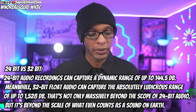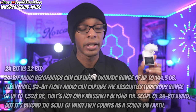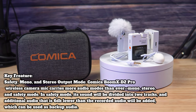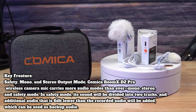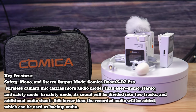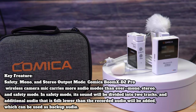This is the white variant — there is a black variant available — and it's a 24-bit audio wireless lavalier system. Before you go, I know some people say if it's not 32-bit they don't want it, but this actually has a safety track. What the safety track does is save your audio similarly to 32-bit float. If you set the gain to 12 dB, it records a safety track at negative 6 dB, so if audio peaks you still have that backup.